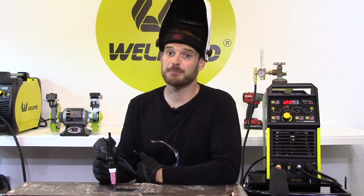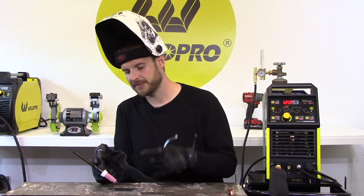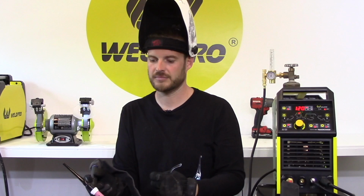Once the weld pool becomes established, you'll want to begin traveling. We travel in a leading direction, meaning there is a backwards angle to our torch. It's important that that travel angle not be more than about 5 to 15 degrees off center. If you have your torch like this, the gas is flowing out of the end of the cup. It can easily draw air in with it. This can create weld contamination.